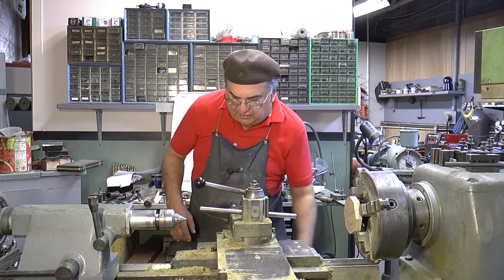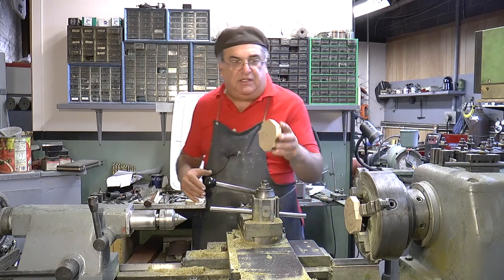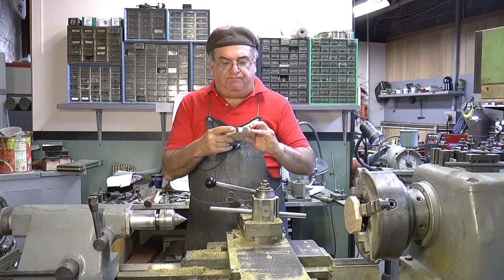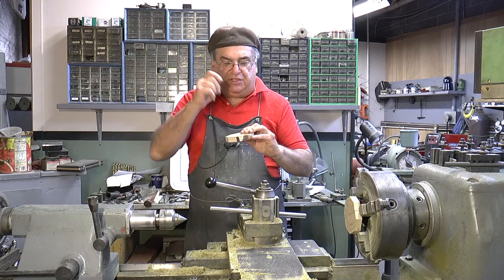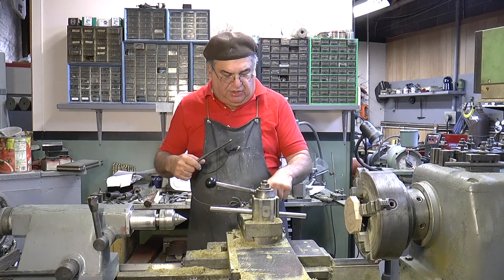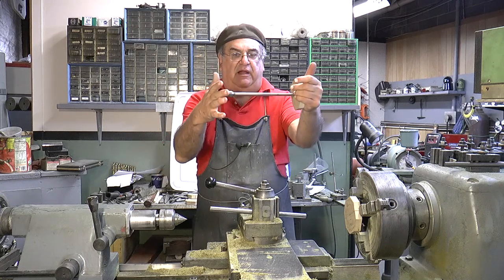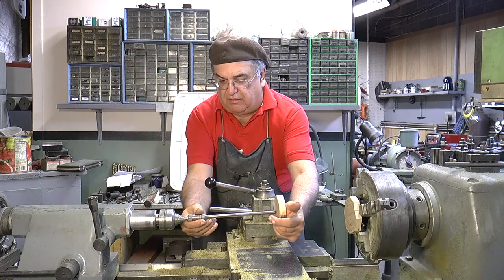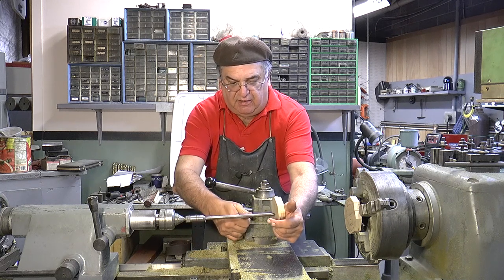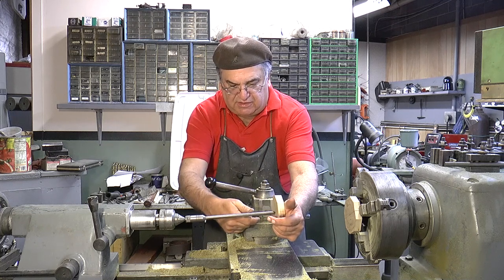Now I'm working on these locks and I have a cross in the middle here. I just took a center punch and lightly punched a little mark in there. Why? Because I'm going to use what's called a wiggler. It's spring loaded, and I'm going to put that in the center. As this is going around, it's going to wobble. I put the indicator here and keep indicating until it's just right — indicate the face, then indicate this, back and forth until you get it just right.